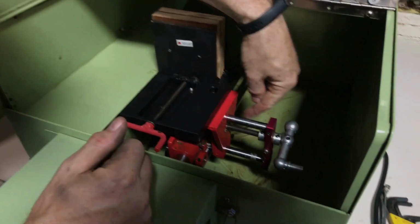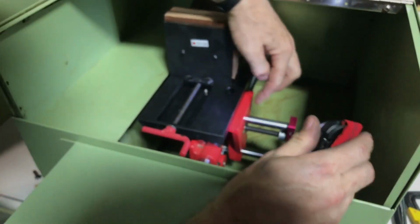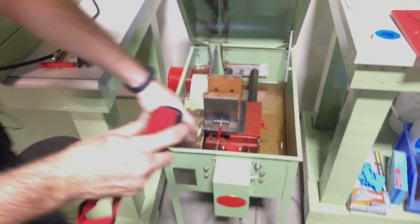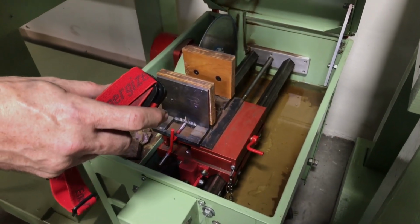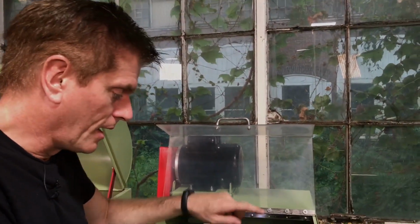So you'll notice that these two hardened steel shafts go through the center of this carriage. Now, if I run a water-based coolant in here, I'm going to get oxidation, and this crossfeed's going to seize up. This saw down here, again, crossfeed bores going through here. We had a customer run this with water and seize up the carriage. Literally, the only way I got that apart was by hammering the shafts out. It was a mess. So if your buddy says run water, run away from your buddy, because he doesn't know what he's talking about on this particular topic.